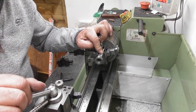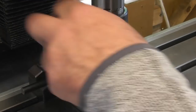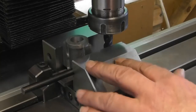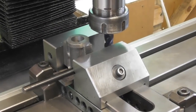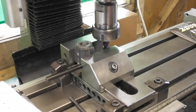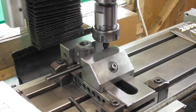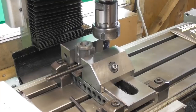I'll take the whole part out of the chuck now and go to the mill. I've got the part sat down on the machine face hard on a parallel - the rear face is actually square to it, it has got a bit of a dome in it but it's holding flat and square to the bottom. I've put a piece of round bar in the V in my jaw and squeezed it back, tightened the vice, tapped it down with a rubber mallet and the parallel is locked solid. I'm going to bring the quill down, touch the cutter on the parallel, lock off the quill, set a zero on the quill, then zero the Z-axis on my DRO. I've zeroed the Z-axis and I'm widening up.